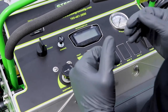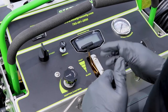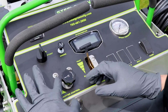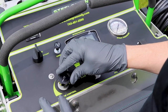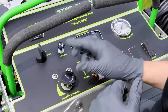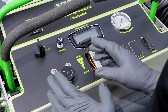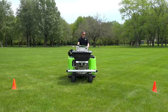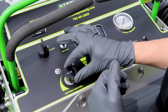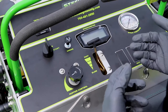To get your machine's spread width calibrated to the width you want, first start your machine and rev it up to full throttle, just like you'll be running it in the field. This knob on your dash is the hopper control knob — as you turn it to the left it increases the spread width, and as you turn it to the right it decreases the width. A good rule of thumb if starting from off is to take it one rotation out, then watch the spread and turn it up until you reach 16 feet or whatever distance you're going for. In our case it was just under a quarter turn to reach 16 feet.